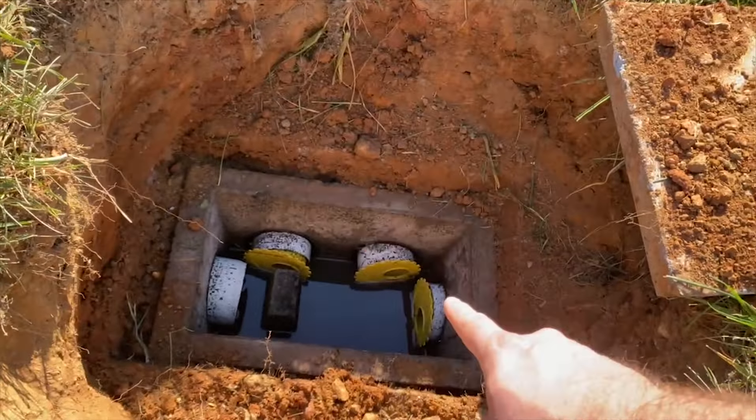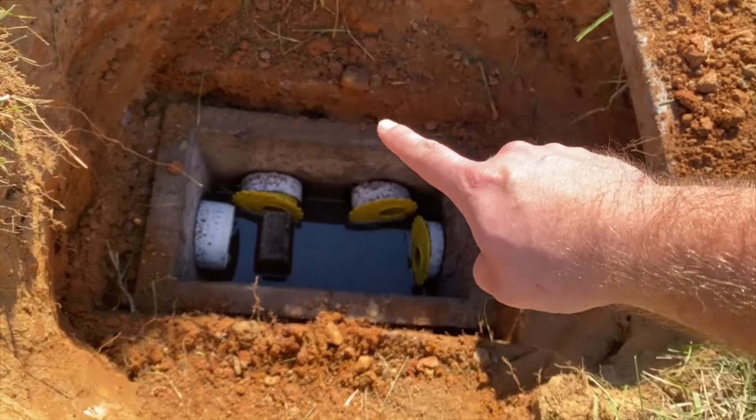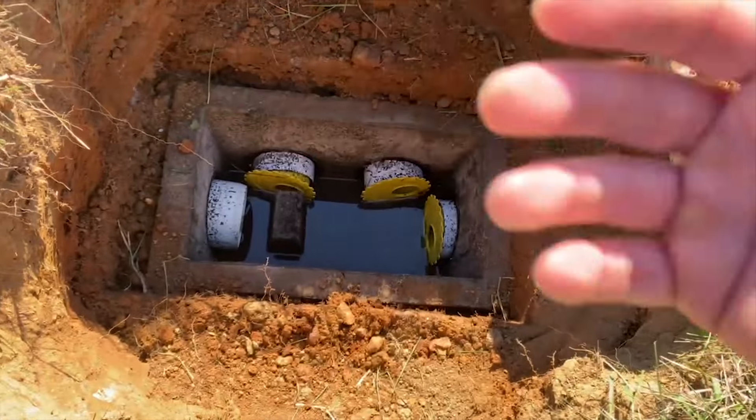The problem is if you don't do anything about it and you start oversaturating that specific trench, what'll happen is you get too much water into the trench and you run the risk of it backing up or surfacing to the ground. In our state, anytime you have sewage that surfaces, you run the risk of a neighbor saying that you're discharging sewage in an improper way. You can end up having to pay fines and being forced by the county to actually do something. It's mostly just a health hazard — you don't want sewage water coming up to the surface and having kids potentially run through it.